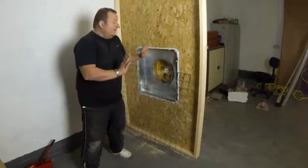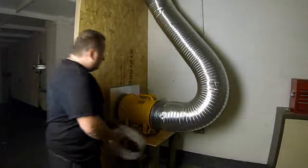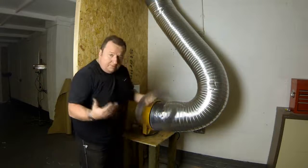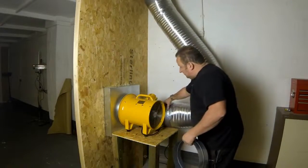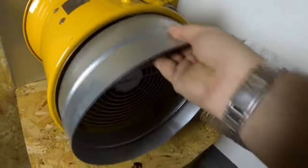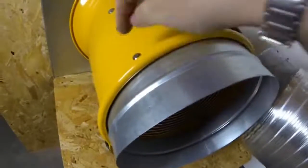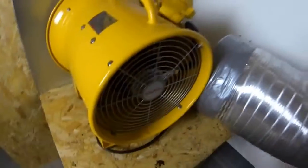It's a nice little finished way of attaching an explosion-proof fan to our booth to take away the fumes, directly vented outside. As you can see, that's the pipe that's going to sit inside. We've got one of these 12-inch flanges, which fitted lovely just inside this flexible pipe there. This 12-inch flange fits nicely inside there. All we're going to do is take the four screws out that hold the internal grille, then mark them, and fix them through into this flange so the flange is held in place — and then that will be the permanent fixture.